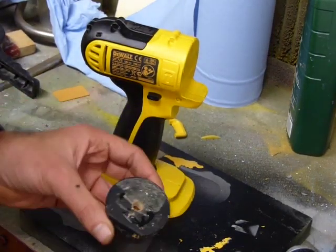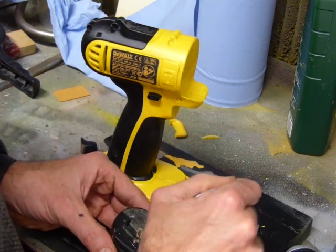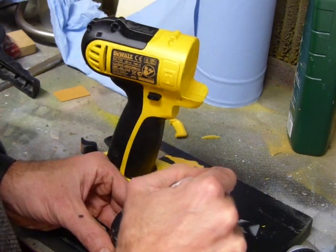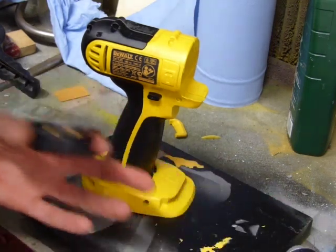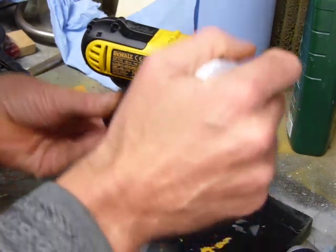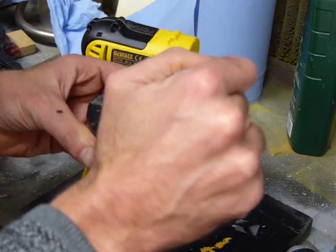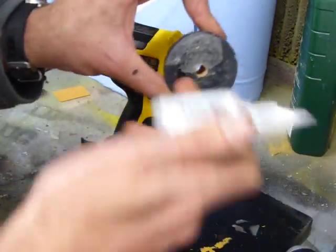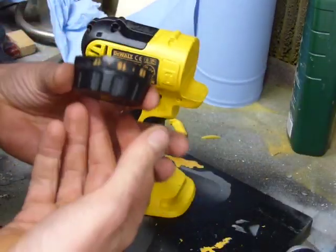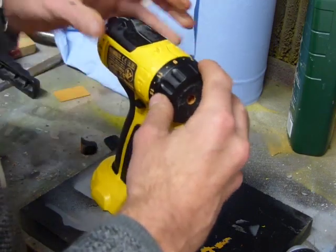So these last bits I'm going to super glue on, I've decided. Could use hot melt, could be messy, or epoxy resin. The latter two have the advantage of having a bit of forgiveness in gaps, whereas super glue really wants to be quite a tight fit. It should be quite a tight fit on this anyway, so what I'm going to do is glue this first bit on. I've drilled a hole through there to locate it centrally as well. So carefully just stick it on like that.